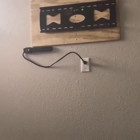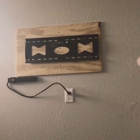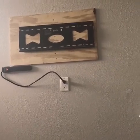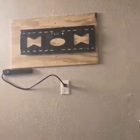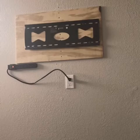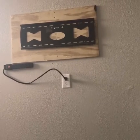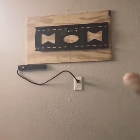I need to go to Lowe's to get the bottom cover and some other stuff I realized I didn't have. I'm going to take off the old wall mount back plate and install the new back plate for the new full motion tilt wall mount. I'm going to lower it some and move it over to the left, but the board is going to stay in place — it's drilled into the studs. This is how I mount all wall mount TVs with any weight. You can center it on the board, and when people mount directly to studs the stud isn't always in the center of your wall. This way I can mount the mount to the board at any location and it stays put.